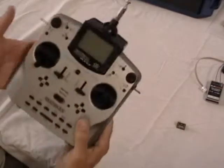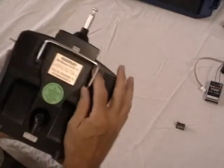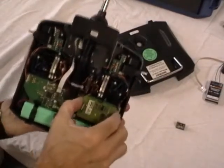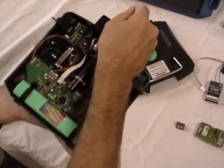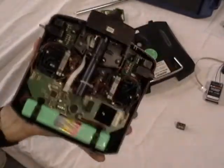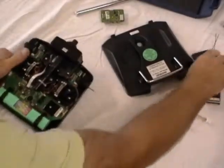The next step is to get your radio ready to convert. For the Multiplex Royal Evo 12, it's a pretty simple step. Slide off the back cover, then remove your 72 megahertz module - I've got a scanner in here also, but it all comes apart as one unit. Push the antenna down and pull that out, and from there you're ready to start your conversion process.